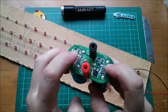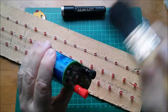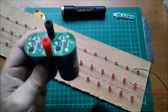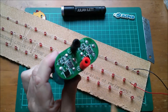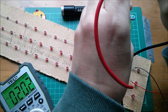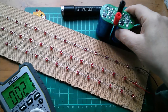This should be reasonably fully charged because we saw the lights on earlier. This is a bit mucky, actually — I think I'll just give this a bit of a brush because it sits out in the shed and stuff drops off the ceiling, roof, onto everything. Spiders get in there and they build webs, and the webs fall down and dust falls down. So I suppose we could measure the voltage across here as the first thing I do. Make sure it's not on amps — it's not, so that shouldn't go bang. And yeah, 5.3 volts. So that's pretty much fully charged — 5.4 nominally, that goes up to.